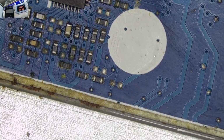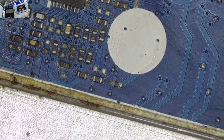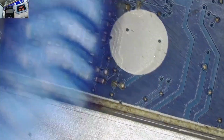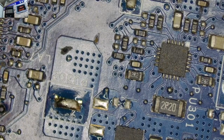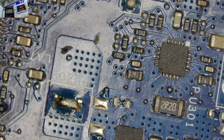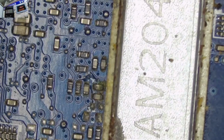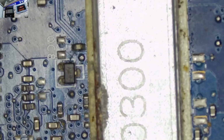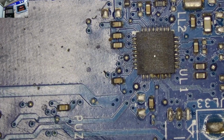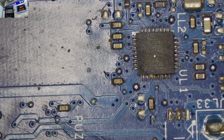We had this video before. You let your chip get covered by dust or dirt, your motherboard will overheat. And in humid weather, you might have your machine not working because the dust will grasp some moisture, and then the current will pass through those components, and the short will appear, and a component will get shorted, or maybe the motherboard will die. So I can already see a chip here that I don't like what is happening here. So what is this here?